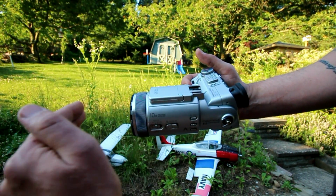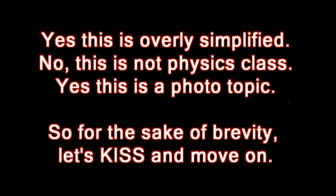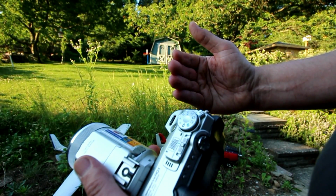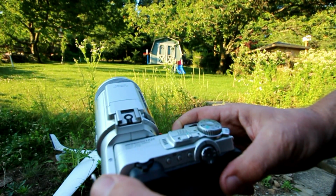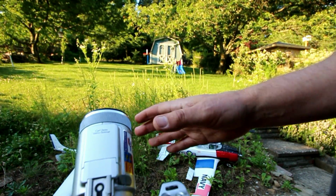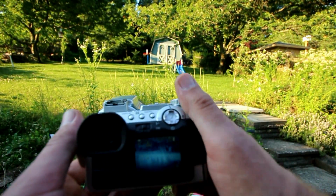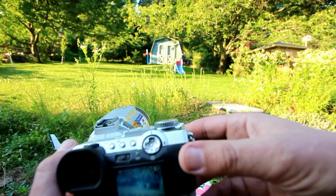But infrared is going to focus way out here. Ultraviolet is going to focus way back here. Whenever we remove the IR cut glass out of the path, it's really, really hard for this camera to decide what to focus on. Even if all we have on here is the IR 850, and we're only going to use the 850 filter on the camera, there's still going to be a slight bit of a struggle for the camera to focus at the point that the visible light would have focused on that sensor.